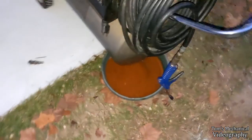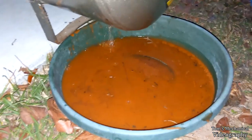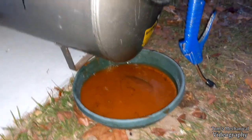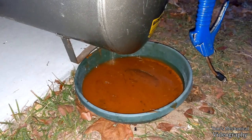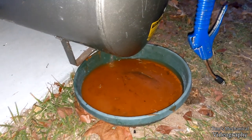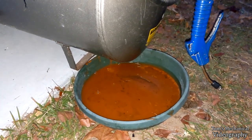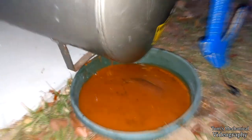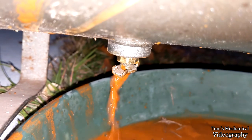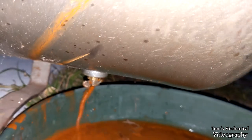After about two years of trying, I finally got this drain out of my dad's air compressor — that's Charleston for you. I don't think he's drained this thing in about 20 years, and there's probably close to a gallon or two in the tank. There was so much buildup that the brass fitting was plugged, and I had to actually drill a hole through the fitting itself so that I could stick a nail through it and capture that on the thumb knob.